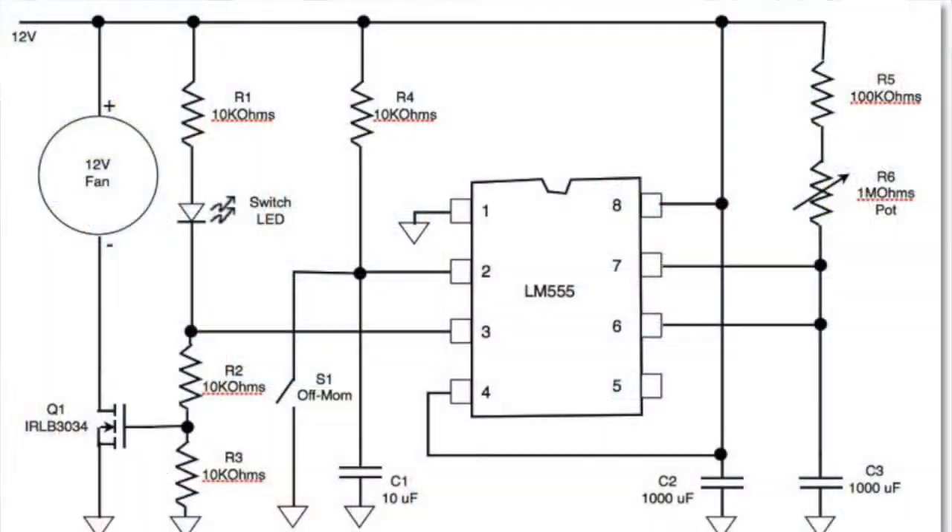So I'm using 12 volts DC, not AC, so I can't use a triac. I've got to use something else. You can see on the left-hand side the 12-volt fan, and the thing that turns it on or off is Q1, which is an International Rectifier MOSFET — it's a 3034. These are really cool. They're in a TO-220 package, and I think the on-state resistance is guaranteed to be below 7 milli-ohms. The typical is like 2 milli-ohms. It's incredible — basically it's a dead short, at least as good as a regular switch.